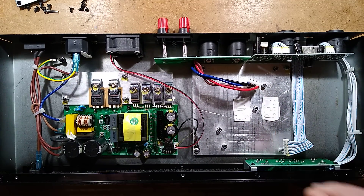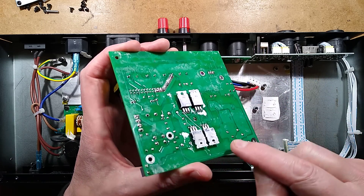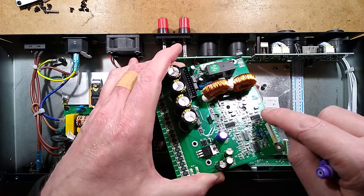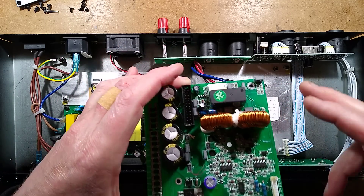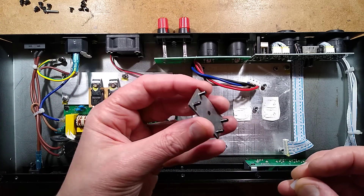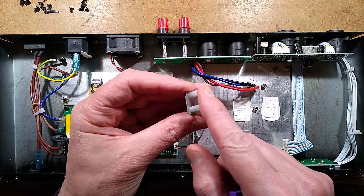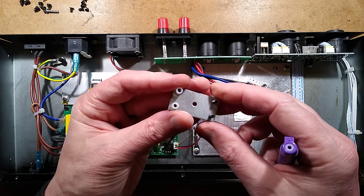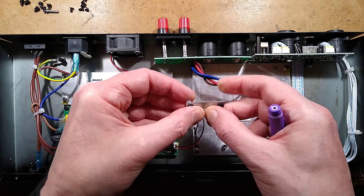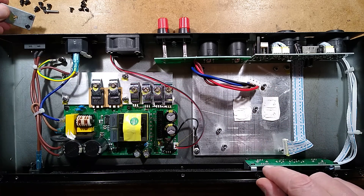The reason I removed the amplifier board was to see how they've mounted the transistors. They've got these transistors folded flat on the back, and there's a plate that goes through — the transistors are physically pressed onto the heatsink by this plate. It's a metal plate with four screws and a plastic spacer. They tighten a single screw in the middle really tight — the plate is deformed slightly — just to make sure all the transistors are pressed firmly into contact with the insulating pad on the heatsink. That's very good.